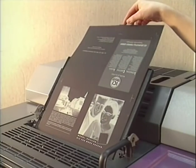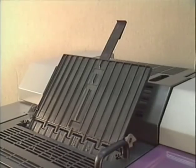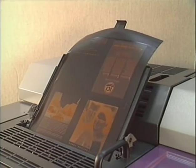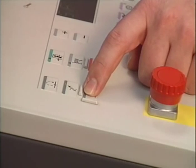Changing polyester plates is done the same way. The surface of the polyester plate should still be wet for trouble-free plate ejection. After a press standstill, the plate should be pre-dampened by special function 01. The plate can also be removed manually if an auto plate error occurs.